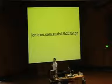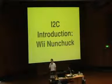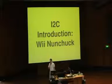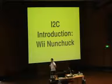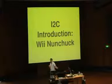Yes? Other than the one-wire data chaining and the parasite power stuff, would you say there are any advantages to this differently, other than what you don't get with an analog sensor? Probably, well, the theoretical advantage of the one-wire stuff is that you can run a single pair through a large area and have a whole lot of multi-drop system basically. So you don't have to run an individual line to each one. So that's the major advantage of using a sensor that uses a built-in communications protocol rather than simply outputting a value to you.